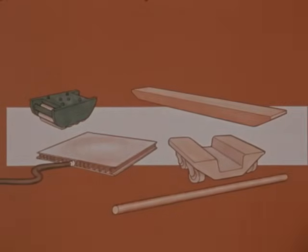When moving equipment, there are several methods which may be employed: dry skidding, wooden or pipe rollers, heavy steel dollies, endless roller chain skids, and compressed air casters.